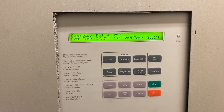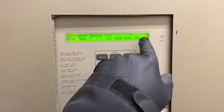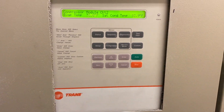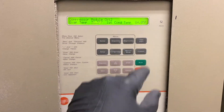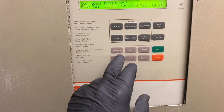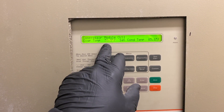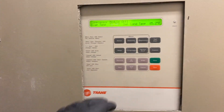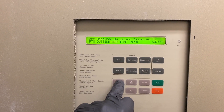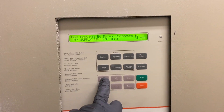After running for a while, circuit two is at 37° saturation on the evap and 83° on the condensing side. It's about 55° outside, so we're a little over 30° above ambient for our condensing temperature — a bit high, but could just be a dirty cooling tower. I haven't been up there yet. Circuit one looks about the same. Refrigerant-wise it looks okay, not freezing up. Return is 78°, supply is 54°, so about a 23° delta T between supply and return.